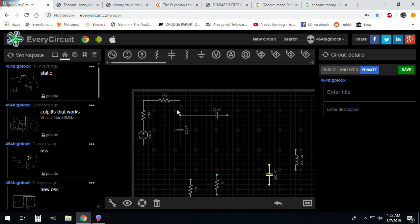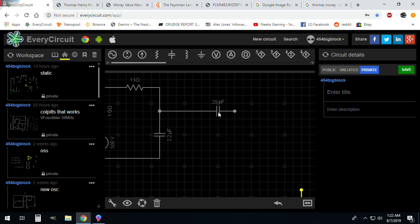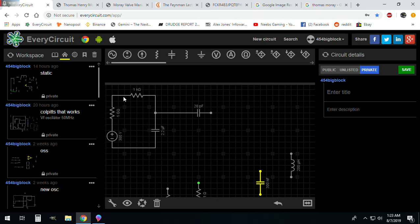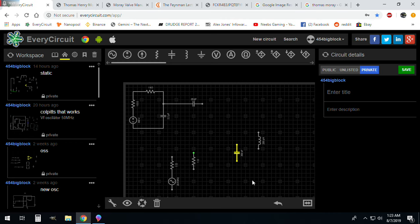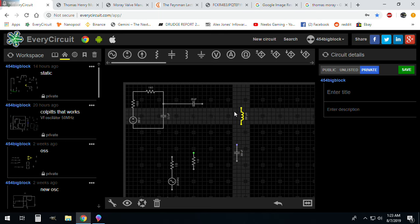And the thing is, this antenna that you got up here, depending on how big your antenna is, you could draw a tiny amount of power super quickly. Like in the megahertz, you're dumping this 20 picofarad capacitor in the megahertz frequency. And because it's such a small amount and you got a nice big antenna, it's refilling just as quick as you're taking it. So this is like your reserve tank here, and this is getting refilled as fast as you can take it. So you want a high frequency, I would say 100 kilohertz or better oscillator circuit.